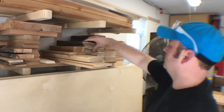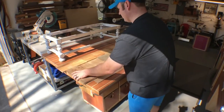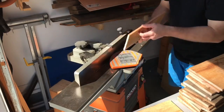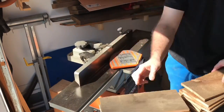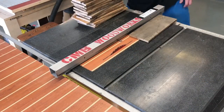I make my way over to the lumber rack and I have some old pallet wood or fencing — I'm not really sure. I cut a paper template out of the tabletop size and I think I got enough wood to make this happen. I go over to the jointer, joint one edge of each board, then reference that edge against the table saw fence to cut them to final width.